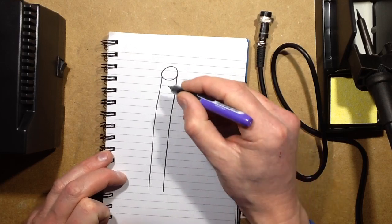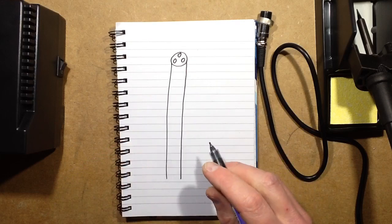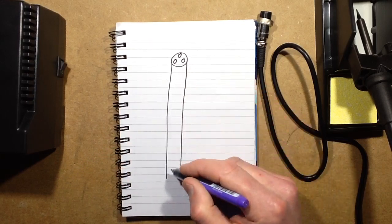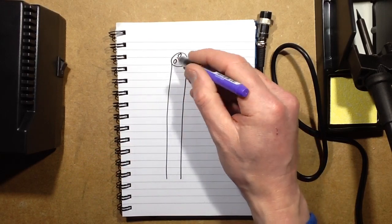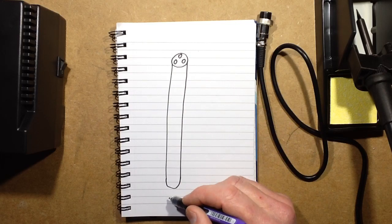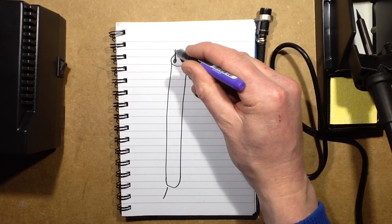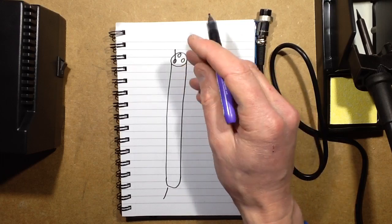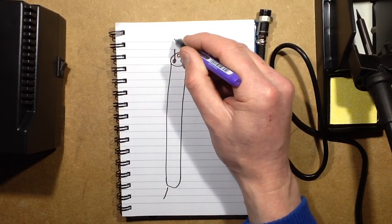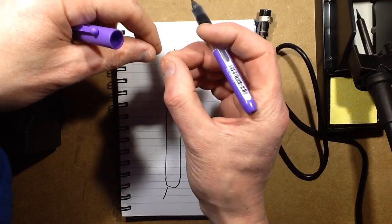This is the heat element bit with 3 holes. These holes are just 3 perfect holes that go right down the full length of the ceramic rod, and 3 wires come up them. The first wire that comes up inside is for a thermocouple, and the thermocouple is a joint between 2 different wires, 2 different alloys, with a little spot weld on them.